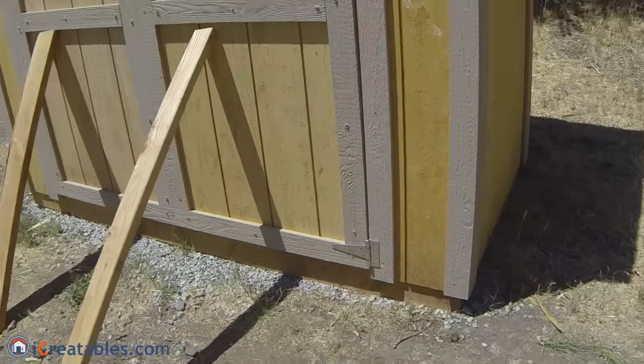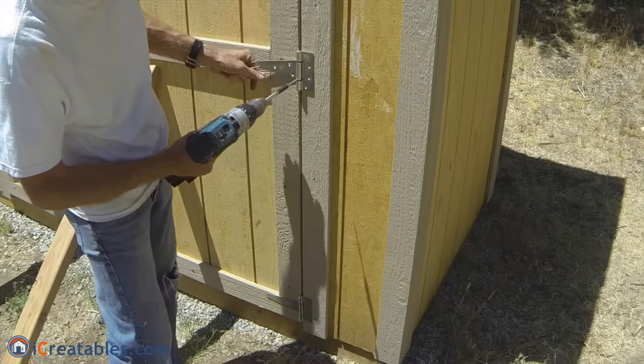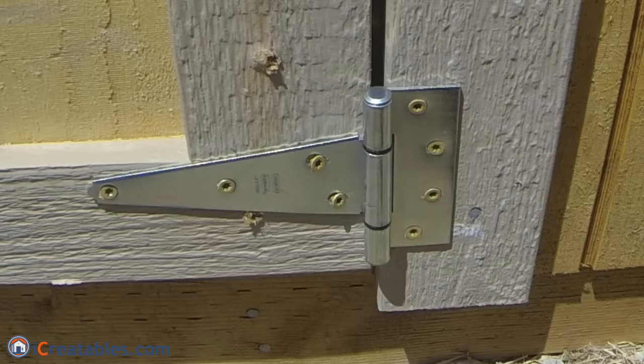The bolt should also be aligned vertically with the gap. When the hinge bolts are not in line with the door, they cause the door to bind when it is opened. The top and bottom hinges should sit so that their edges just pass over the inside corner of the door trim. This helps ensure that the screws will hit the inner door rail.